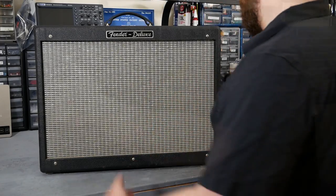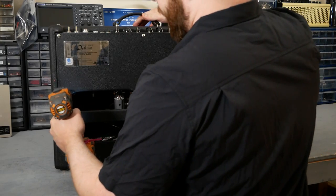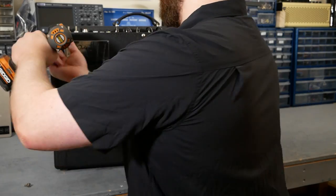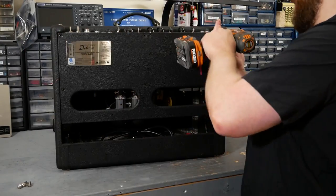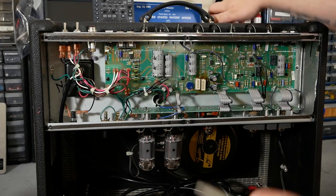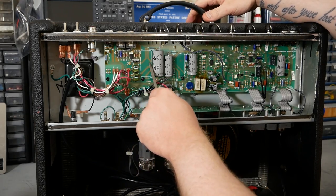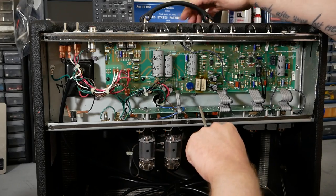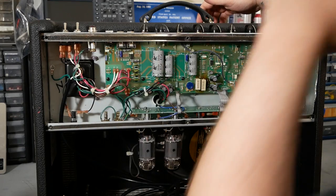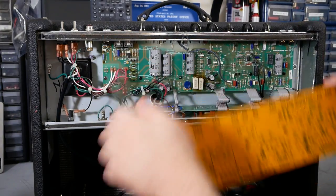So let's go ahead and crack it open. These amps are pretty easy to work on because the chassis is mounted vertically — just six screws here to get into the chassis. Here's the inside of a Hot Rod Deluxe. If you watch tube amp repair channels, you've probably seen the inside of one of these. This main circuit board has to come out. The secondary board for the tubes is also going to come out. The output jacks, fuse, power cables, switches, lamp — all that's going to stay in place. And then the new PCB is going to fit right in here using the original screw mounting positions.